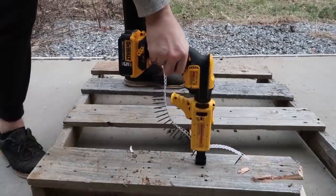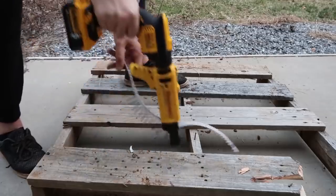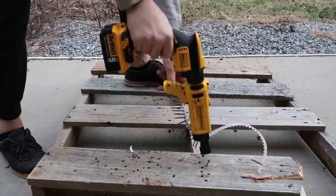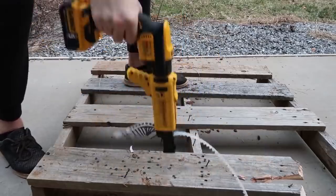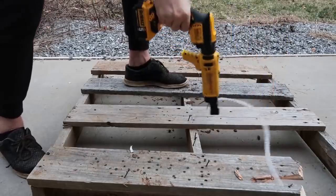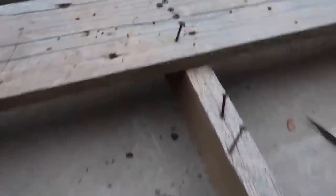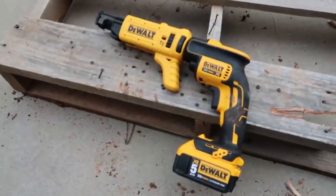You know I was fixing ground-bound, putting up plywood — gosh I wish I had this tool. Look at that, you can just keep going. Some of them do slip — you don't want to go too fast, you want to go firm, that way they will seat properly. Amazing, look at that — all the screws went in. Whenever one didn't go in it was because I was way too much in a rush. So you want to do it slowly but firmly. On this side all the screws went all the way through as well, as you can see. Wow, I wish I had this tool a long long time ago.